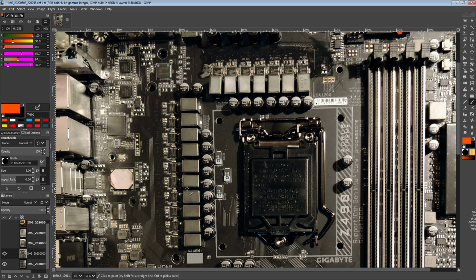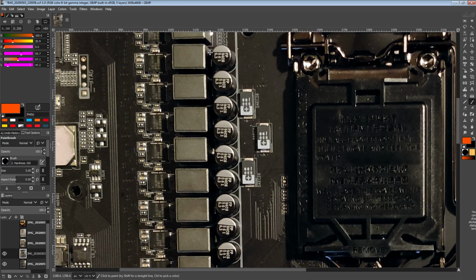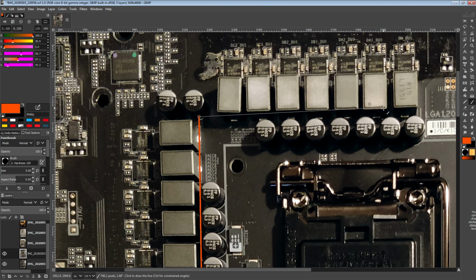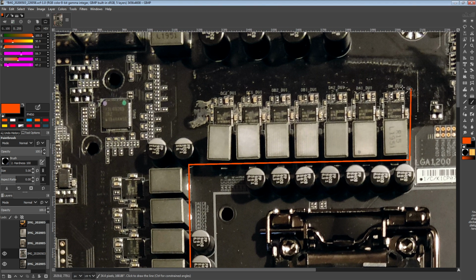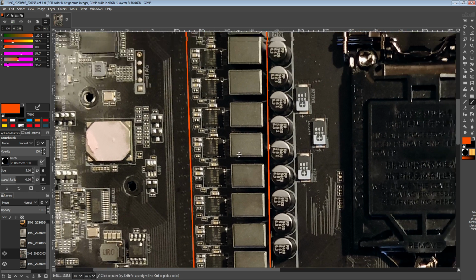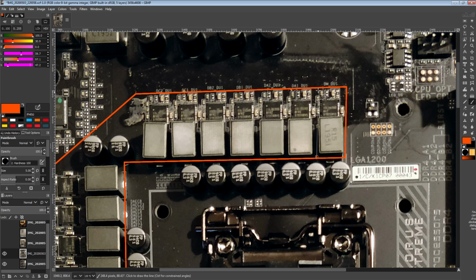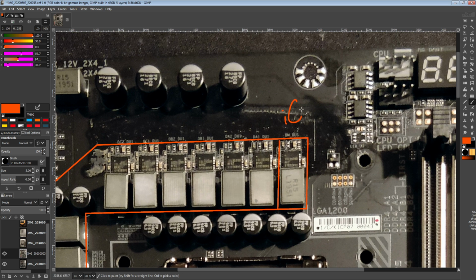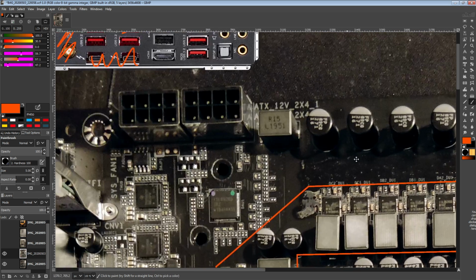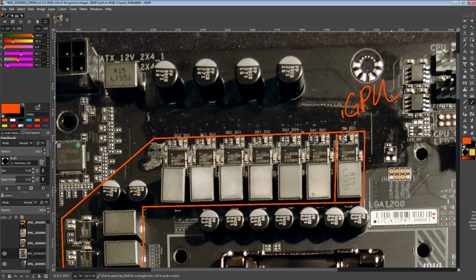Anyway, let's get to the power delivery, because there I don't actually have any complaints for the power delivery here. So Gigabyte for this board has given us the biggest VRM that they make for Z490, which is a given. And they do include an iGPU phase, which, as you can tell from the HDMI port on the rear I/O, so you can actually use QuickSync.